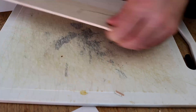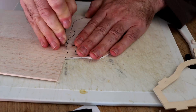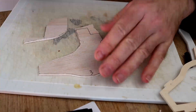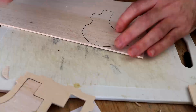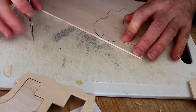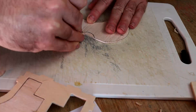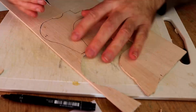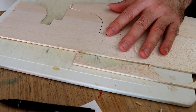What I'm hoping is to get these all done, hopefully dry enough to put the pieces together in the base and let that dry overnight, then work on the curved sections tomorrow. The curved sections are balsa wood again. To make the balsa conform to the fairly tight circles, I've used two layers of 1/16th balsa wood. You cut the first layer out, glue it in position, let that dry overnight, then stick another layer on top and let that dry. I use sellotape to hold the bits in position while drying.